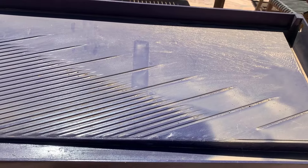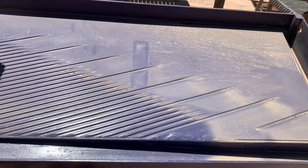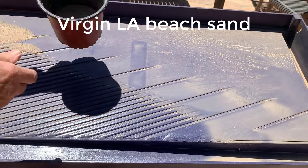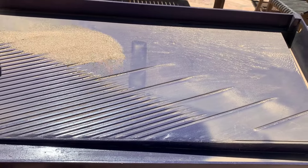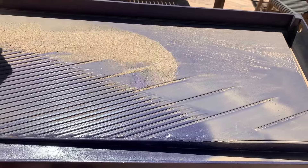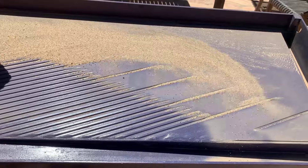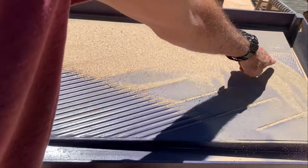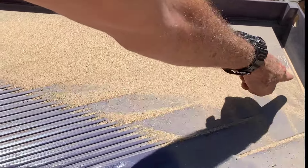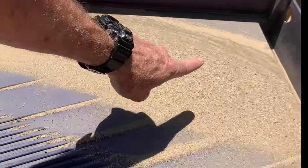This is beach sand that has quite a bit of fine black material in it, and I'm using this bucket as a classifier — I think it's got eighth-inch mesh. Because of the bumping, the material moves quite rapidly across the table, so I think the feed rate could be quite high. There are rings of black sand up there and a lot of the lighter material is falling, but the black sand keeps getting pushed in the bump direction because it's heavier.